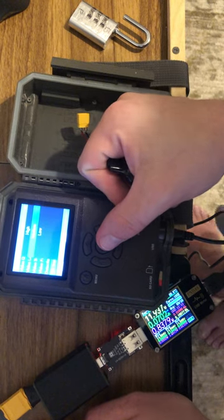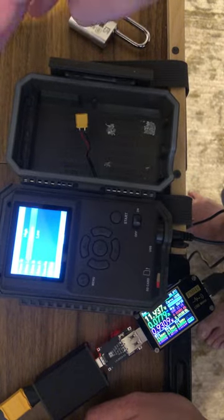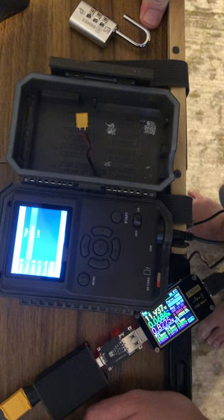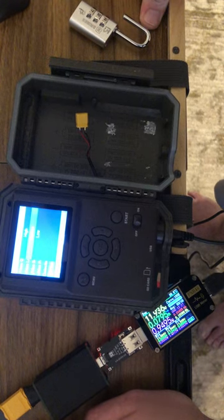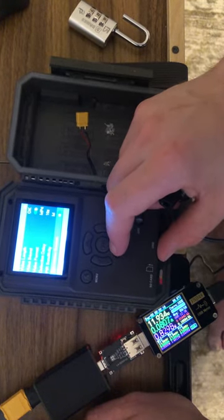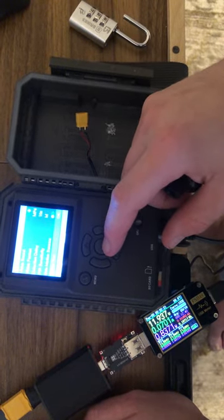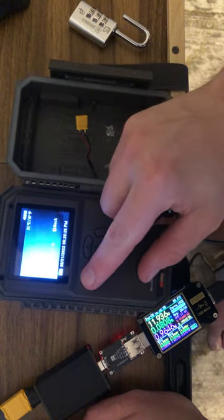Medium sensitivity was good for PIR, but my location was bad — you don't want the sun's angle and shadows setting this off. Medium should work okay; if you're still getting a lot of false positives, it's because you have it in a bad spot most likely. Side motion sensors — I didn't look into that too much, I only care about head-on detection. There's also a motion test feature.